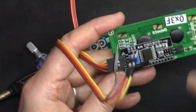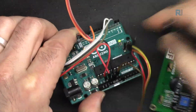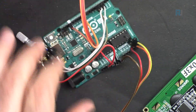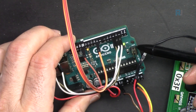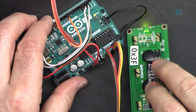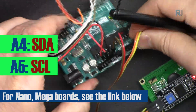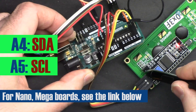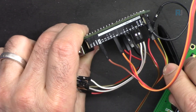For the LCD — which I have a separate detailed video for — the ground brown wire connects to Arduino ground. The VCC second pin connects to 5 volts; I connect this to the ICSP pin in the corner, and as soon as you connect it the backlight turns on. SDA connects using an orange wire to A4, and SCL connects to A5. You can also connect SDA and SCL to the dedicated SDA and SCL pins on the board.